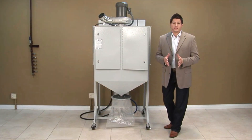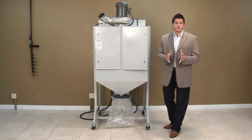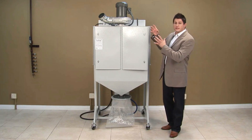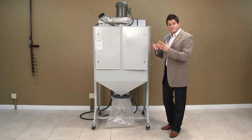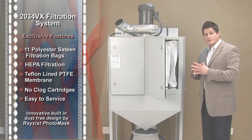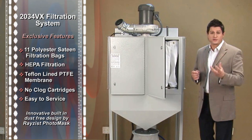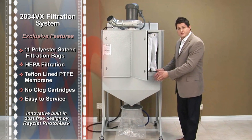One of the most valuable features you'll find on the Razus system is our filtration. Filtration is most important both to you, your employees, and your work environment. Here at the rear of the machine, we start with a very powerful impeller-drawn motor drawing in greater than 400 CFM into that vortex separation. That's separating out the finer particles and dust, drawing them into our 11 HEPA filtration bags. These high-quality bags are lined with a Teflon coating, which keeps the fine particles of dust from clogging the bag like traditional cartridge filters might. That dust slides off the Teflon lining into our disposable liner at the rear.